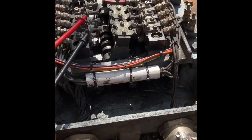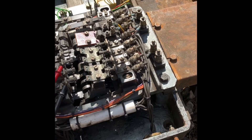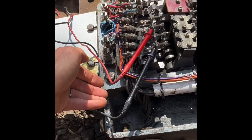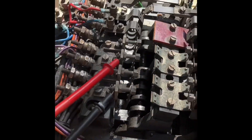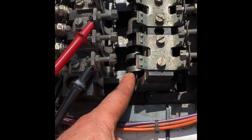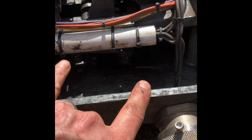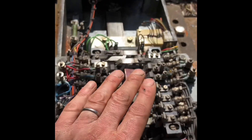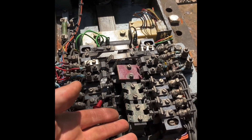Finally, detection. On the old machines that were just wired without couplers, you could undo the four nuts — they're all the same nuts, so an insulated battery T-spanner fits all of them beautifully — and lift the detection assembly completely off to see inside. What you can do is look quite clearly down here: you can see rollers that drop into your groove. Look very carefully and you can see the mechanism has dropped as we've got detection — that's telling us it's dropped into its cradle. If you set it too fine it'll kick out every time a train goes over it; if you set it too coarse your detection should never break.